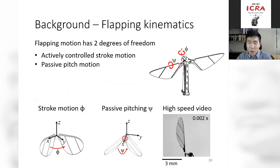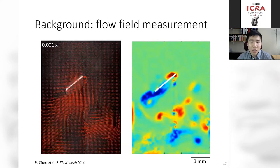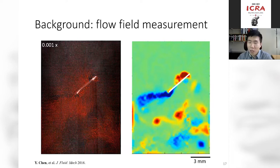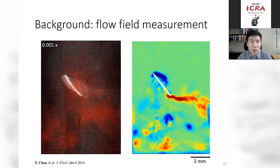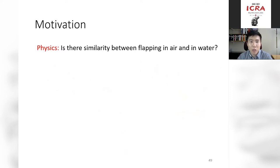First, let me introduce the flapping wing robot. We look to nature for inspiration. A flapping wing robot has two degrees of freedom: the wing stroke motion and the wing pitch motion. The stroke motion is actively controlled by a piezoelectric actuator, whereas the wing pitch rotation is passively mediated by air and wing inertia. This passive fluid-structure interaction is a recurring theme in our research. We developed experimental tools to measure the flow field generated by flapping wing motion, and numerical simulations to understand the underlying physics and fluid flow. Armed with these tools, we're ready to think about interesting questions.